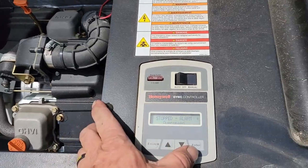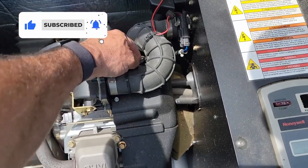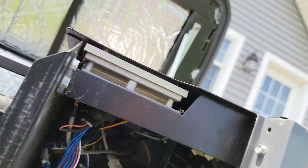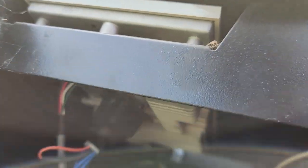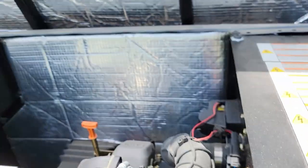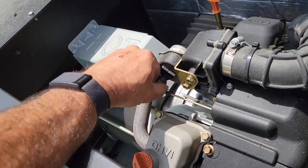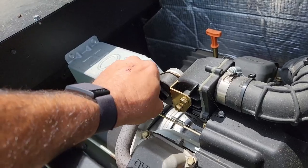That made it do it — it tried fighting me. Might have a stepper motor going out on it. Let's take a look down here, see if it's still plugged in correctly. We might have a motor out. Looks like it's all still plugged in. We need to loosen up some of those wires and check the resistance on them, see if that stepper motor is any good. The motor feels free, but it just seems like it's not responding like it should.